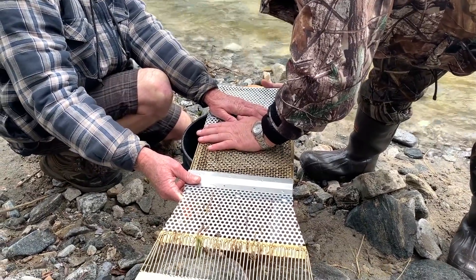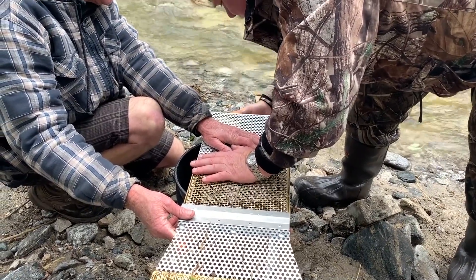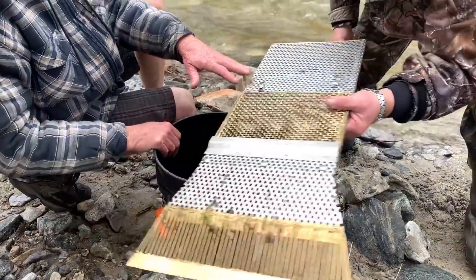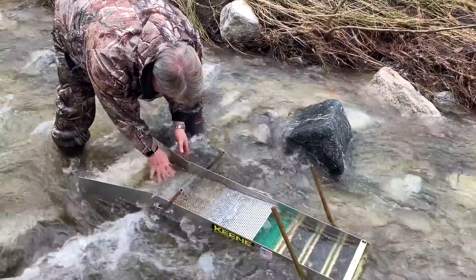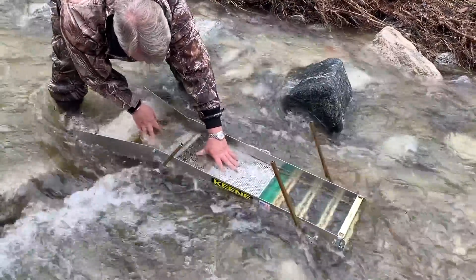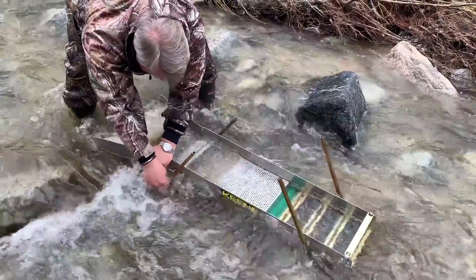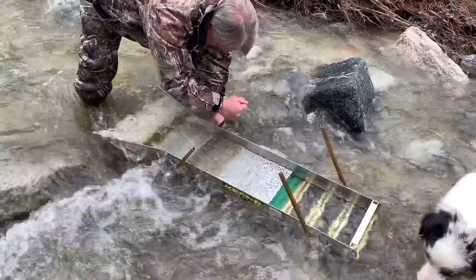For what it's worth, I think the woven wire is working really well. We went ahead and removed the back lip to see what would happen — Pat and I both agree it was creating some funky back pressures underneath the box and forcing some of the riffles to run a little cleaner than they should have. But overall it's been working pretty good, so we put it all back together and are readjusting for another run. So far we both kind of like the woven wire.